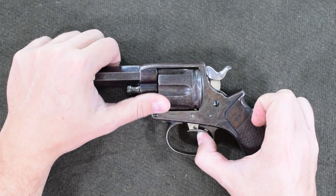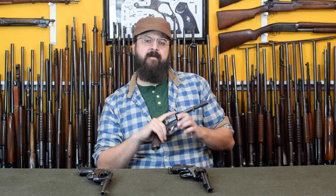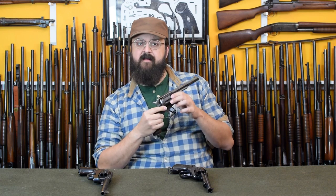If it's nice and tight, awesome. But just because the cylinder has come to a halt, that doesn't mean the revolver is in time. Remember, we're trying to actually align each and every chamber — usually six of them, though of course there are exceptions — each chamber with the barrel as perfectly as possible. So how do we check that alignment?